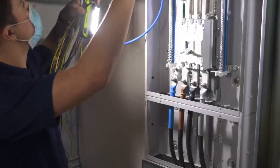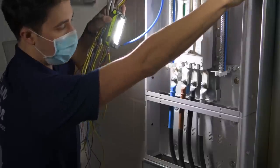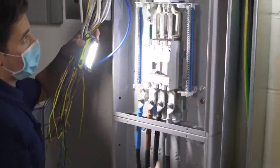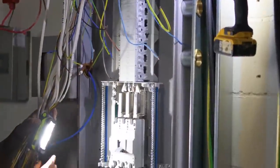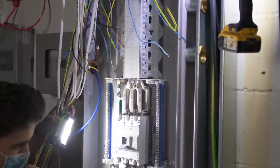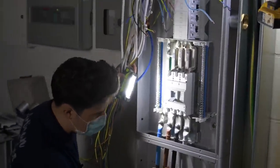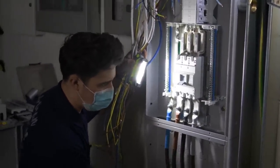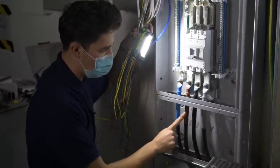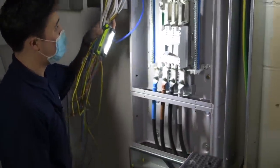Basically, just mounted the board and all the cutting, all the containment and things, got it all ready. I'm using 50mm couplers, basically, just to bring all the cables in neatly to there, because I think lots of these have got loads of length, and then a few don't really have any length to get to where they need to go to. The main tails I've pulled in, these are 120mm, I think they're tri-rated, really nice actually, flexible tails, super easy to work with. So we've crimped all those, heat shrink them into place, mounted the main switch, got the main earth lugged up and in place. So yeah, we're doing all right.